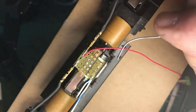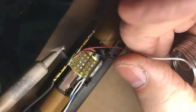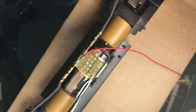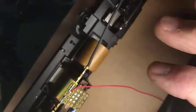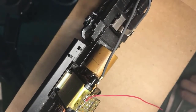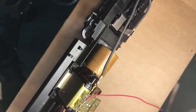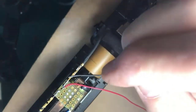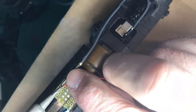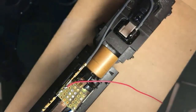Clean the tip. That needs to be a fetish that you have, is you're constantly cleaning that tip to get that old junky solder off of there. I don't usually like to do this, but what I've done here is the wire here is soldered to there. I don't like this. I'm going to put some more solder at that point because I don't feel confident that it's really going to hold steady. So I'm going to clean the tip. Look again. There.